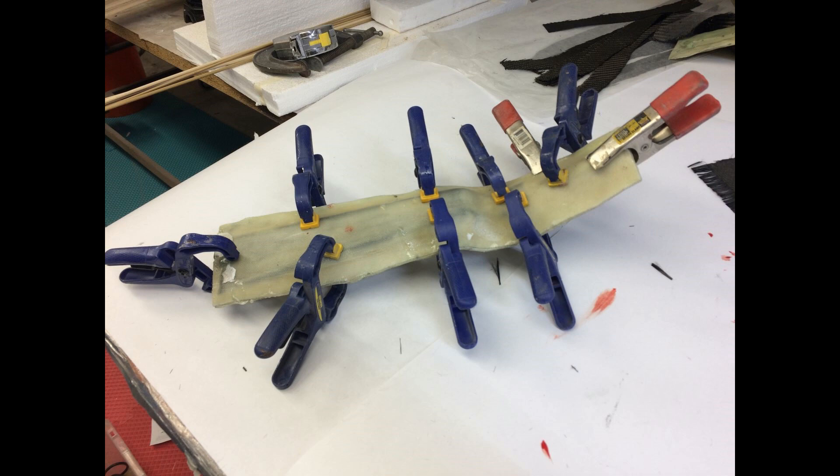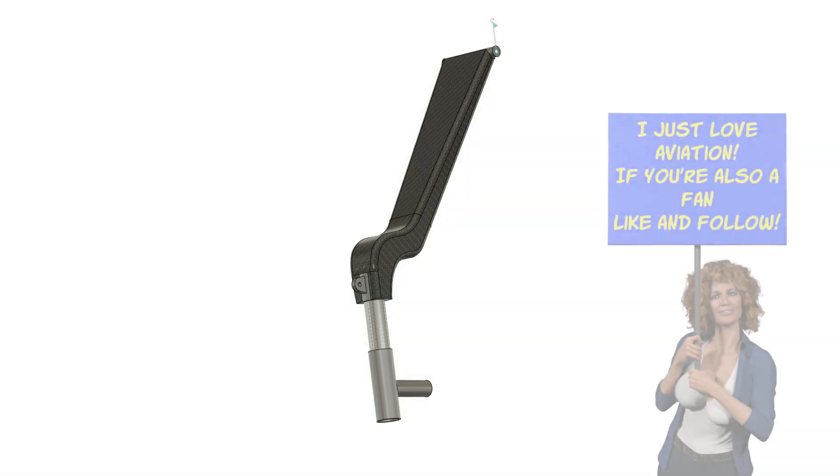When I popped them out, I realized I needed to do a little bit of filling with some epoxy and micro balloons, but realistically that sitting right there is awesome. There's a bearing at where the strut attaches to the wing, and then at the bottom there'll be a spring and some suspension. This turned out extremely good, but there's a lot of time involved. Here is the sandwich being cured inside — it took me a couple of weeks, but I was really happy with it.